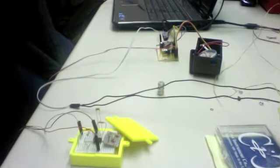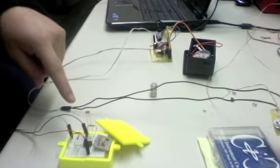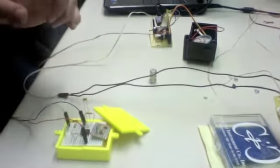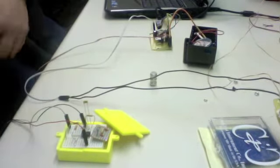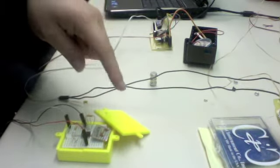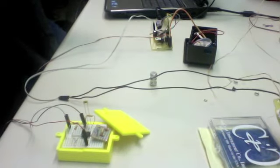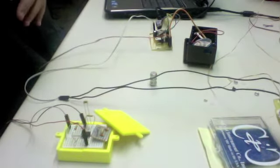So our device will detect neural signals via the electrode, and the electrode will feed its electrical signals into our neural input circuit, which is in the brain box, which will then amplify and filter the signal and send that to the ATtiny Arduino. At the same time, we will have our temperature circuit recording temperature, and that will also send its information to the ATtiny Arduino, which will detect whether or not a seizure is occurring via the algorithm, and then it will tell the current driver, which is controlling our Peltier cooler, whether or not to turn on,